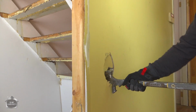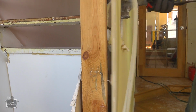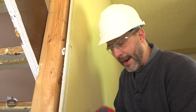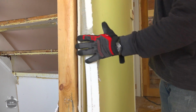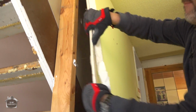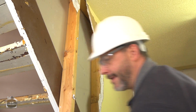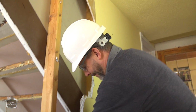And then jiggle, all right? Here's the goal. If you jiggle the drywall, the screws that are in the surface, the head of the screw will pop through the paper and the drywall loses all of its strength. And then you can just grab it, okay? And it usually comes off in pretty good pieces. Remember, the bigger the piece you tear off, the less trips to the dump.